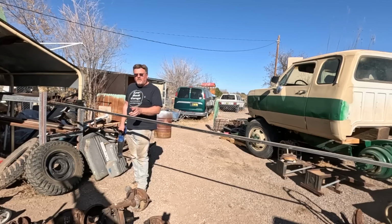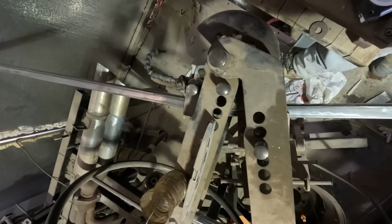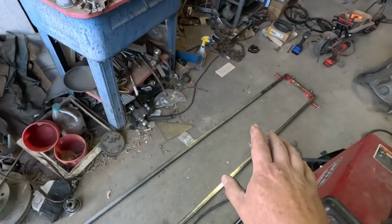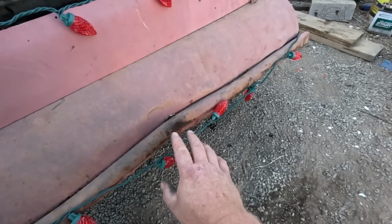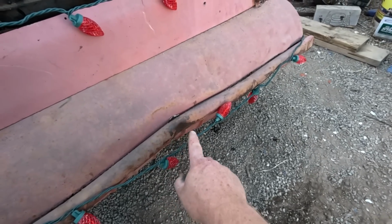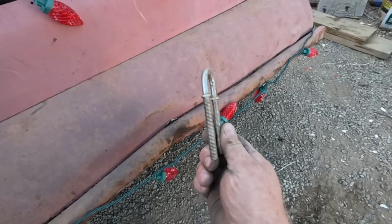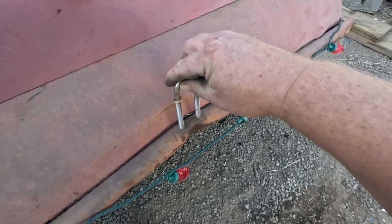I'm going to take a 20-foot length of 1x1 tubing and split it in half. I put in a bend near the front. I added a few cross members, attached them with some globs of weld, and now I got a quick little framework with a kick up at the front. I need an attachment point in the front, and luckily whoever ran this into a tree put it pretty close to on center. I pulled this off an old boat with a bad hull. 2 holes through there should do it.